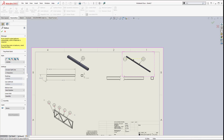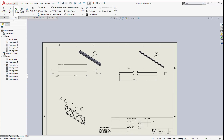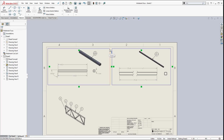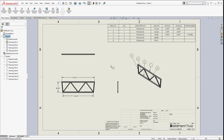On this component I don't have to worry about the lines - the dimensions automatically put the little break symbol on there. I'll add some angle dimensions. On weldments I do see some companies do little outlines like this; as long as you make them look good it should be okay. The main thing is just make sure all the details are in one specific area so you can replicate this multiple times. The key is to use Relative View so you don't have to save out individual parts - everything will update with the main part file. Hope you enjoyed this - keep modeling! This is Steve Darcy with Go Engineer.